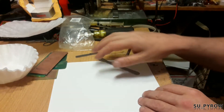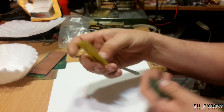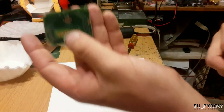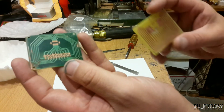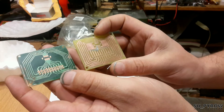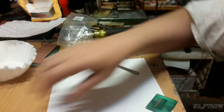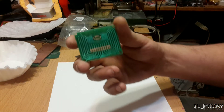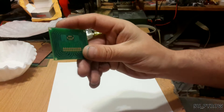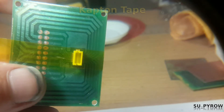Out of those boards, I made another one here. You can see I got some traces in there, but I was able to repair that, so this one passes continuity. This here is the original design — you can see the traces. Then I decided to redo the board design to make it easier for my process. This new design works, it passed, and I decided to do one more. That one came out absolutely perfect, and this is the one we'll be soldering to today.